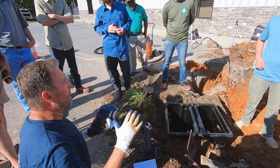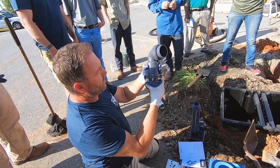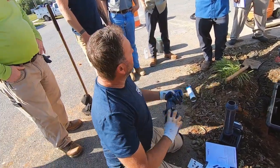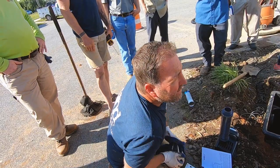We're going to put a bio fall on top — on a pondless it's not so crucial to have this, but it makes your plumbing so much easier when you do have it. Now you've got two places that you can take this apart and take your pump out, making it really easy to service your pump.